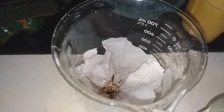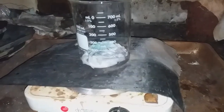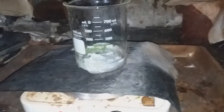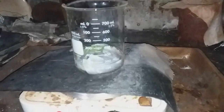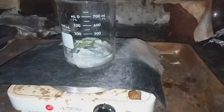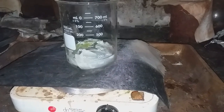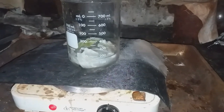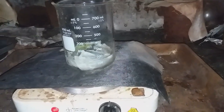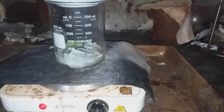Now turn to this beaker to convert to aqua regia. All gold foil is in the beaker right now — let's add 150 ml hydrochloric acid to cover it up. We slowly add nitric acid and start to stir it up. The reaction started — let's cover it up and turn on the fume hood.